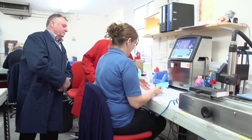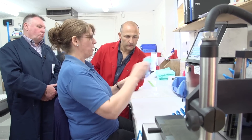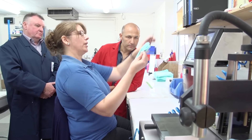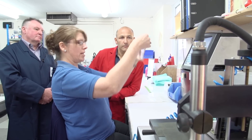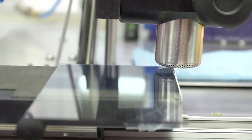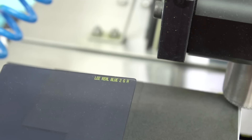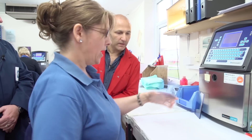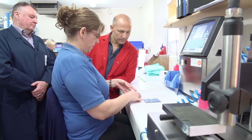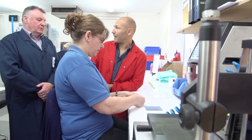So tell us Tracy, what's happening? We take the filter and clean it with acetone just to get any fingerprints and smears off. Then we have a final look to make sure there's no scratches or anything. Then it goes onto this table — that printed the label telling us what it is: a blue grad hard 0.6. Then it just gets a blow dry and goes into tracing paper to give it a bit of protection before it goes into its final soft case pack and box.